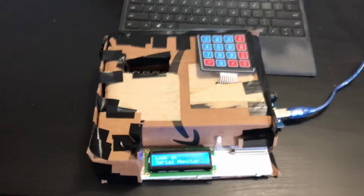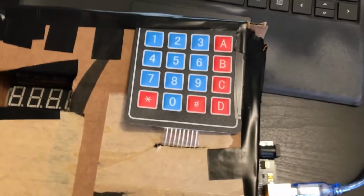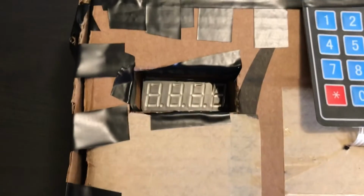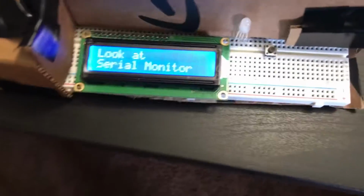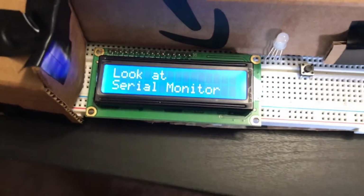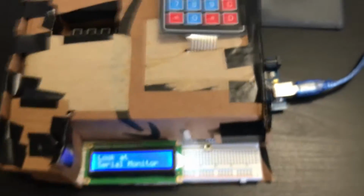The prototype that I created is a quizzing machine. It asks questions via a serial monitor on a computer screen, takes answers to those multiple choice questions via the number keypad, demonstrates how much time you have left on each question through a 4-digit 7-segment display, displays other relevant information via the LCD screen as well as an RGB LED, and there's a push button for extra convenience, basically.